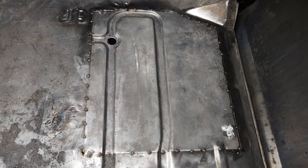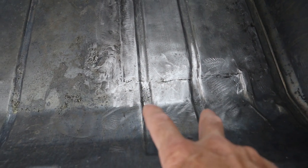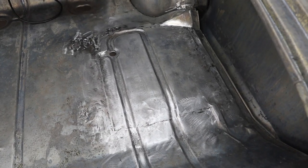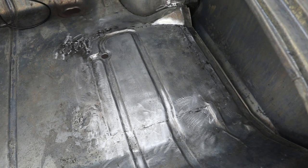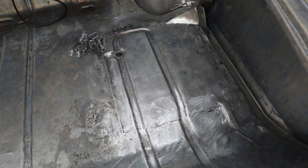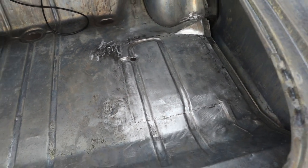It was not super easy but not impossible. The two channels are spaced differently because the seam's right there - the ones in the floor pan on this side did not match that side. Why they stamped them at different sizes I have no idea. So I made a little buck and redid that so it kind of jogs over. And I actually TIG welded it all the way in. I got my TIG welder back from Dave - he's pretty much done with the chop on his Model A. I blew three or four holes and had to get the MIG welder out to fix those. But I TIG welded all that, ground it up pretty nice, and it came out pretty good.